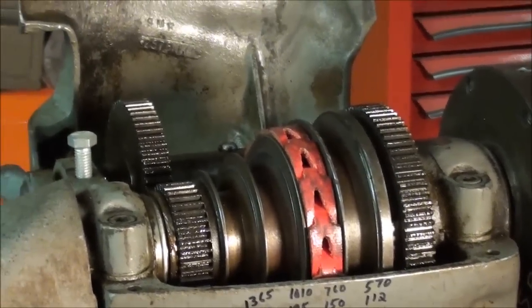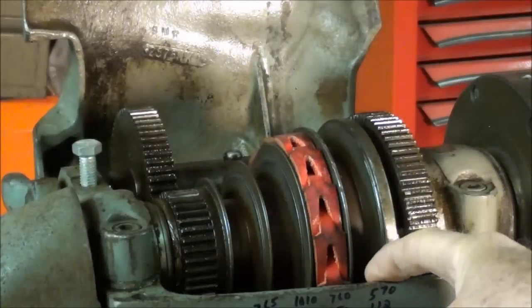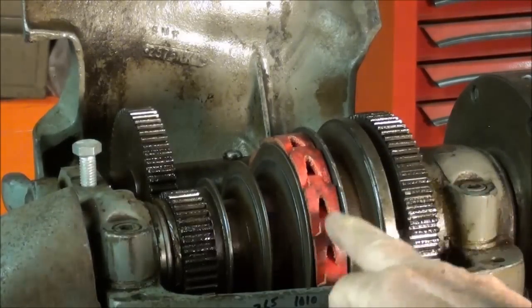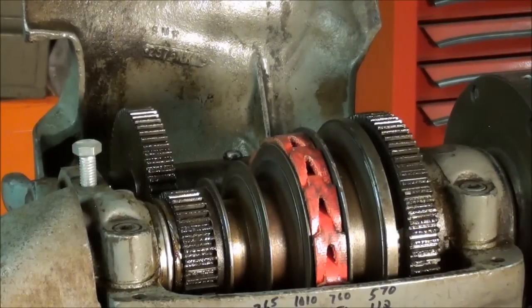I do like this very much, other than moving the belt from this groove to this one — there is a little interference between the casting and the edge of the pulley, so it is a little bit of a chore to move it over. Also note that on the V-belt pulley drive, there is room for four grooves, so we have two extra speeds, including back gears, on this type of drive because it's more compact than the wider cone pulleys.